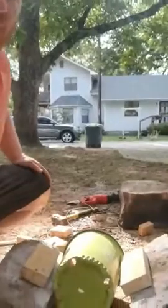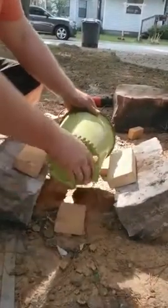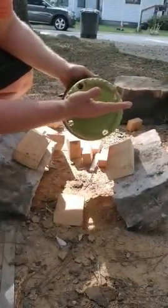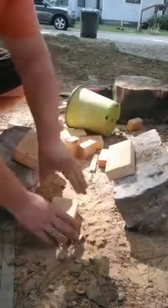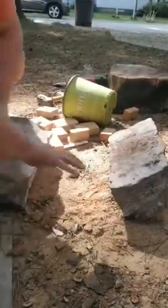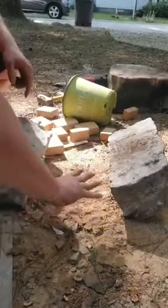So in order to use the compression strength of this stone, we're going to have to create this arch that will make all of the different stones lock in together and compress against each other. I'm going to show you how we do that. Right here I've simulated a little stream, and I didn't cut this thing in half. Your insert for your bridge will only be half of this, because it'll be lying flat on the ground. But imagine this is our channel of our stream running in between these two big blocks. The stream bed is going to be even with this corner right here, and the water's flowing through.